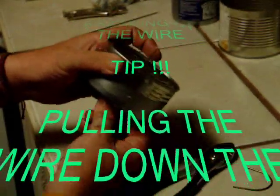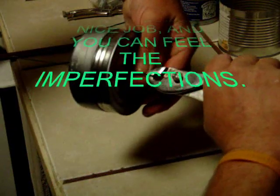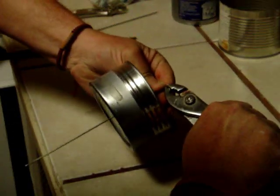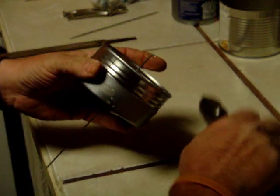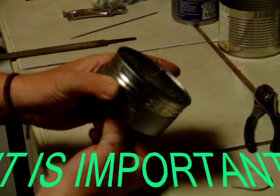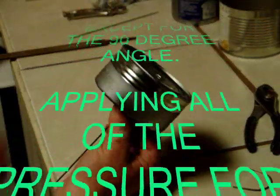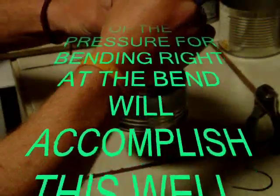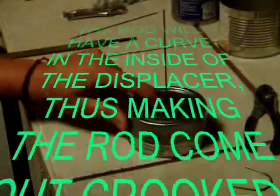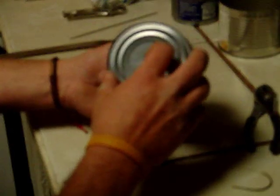I'm going to push this through a little bit further. I want a real sharp bend on this but I don't want it very long, so I'm going to put pressure close to the pliers going this way with my thumb to make this bend get sharp. Because I don't want it sticking out — if you put a curve in it you've wasted the rod or wasted your time. Pull this down, and now you can see by the reflection on it, it basically sits down nice and tight. Because it's in the center, when I spin this it ought to spin nice, straight, and true. I'm going to go ahead and put some epoxy here — I'm not going to waste your time mixing the epoxy in front of you. We'll just show you when it's done.